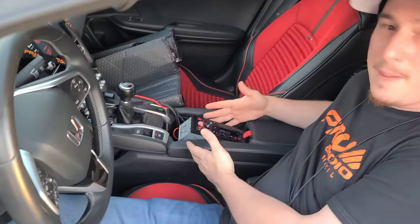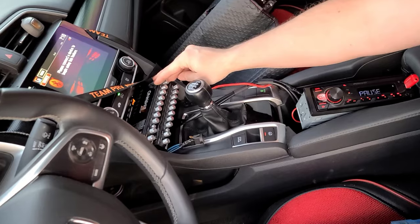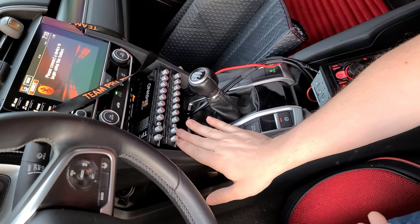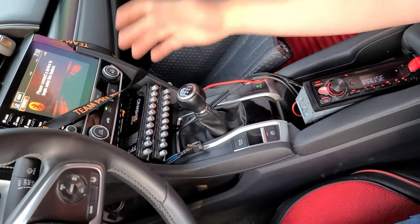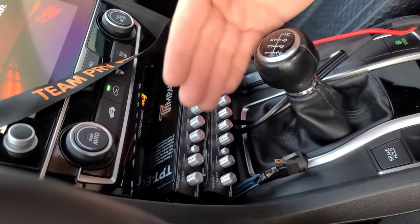I've got a cheap Walmart Pioneer radio that works fine for me. That feeds signal to my two Timpano 7-band equalizers. The one on top I have running my compression drivers and my tweeters, and the one on the bottom I have running the 10-inch mid-bass. Why do I have two equalizers? It gives a stronger signal to the back and also gives me the ability to adjust the volume of the drivers and the tweeters depending on the song or the crowd I'm playing for.